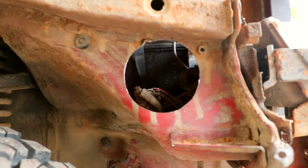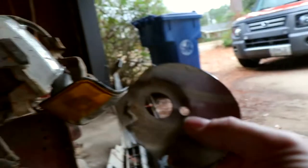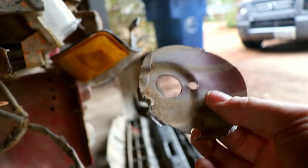The hole is opened up. If you're going to go this way and do the three-and-a-half inch, be very, very careful when you're cutting this, because this is a lot of material removed. As you saw, it'll catch and it will try to break your wrist. So be warned — don't try to drill that sucker in there aggressively, because that is a lot of meat you're taking out in one bite.